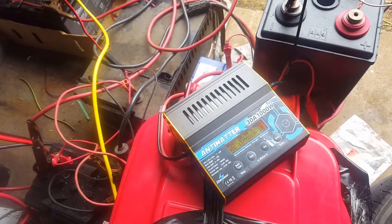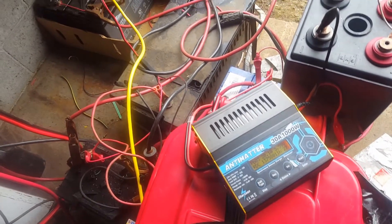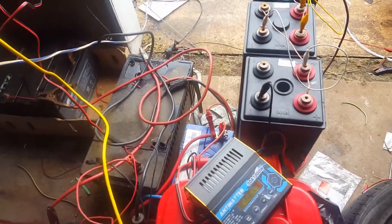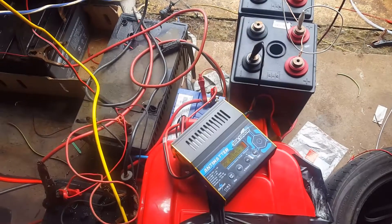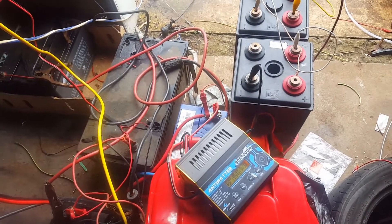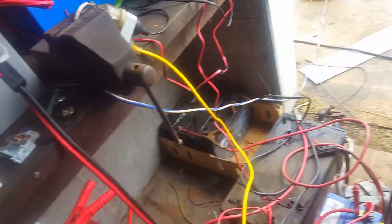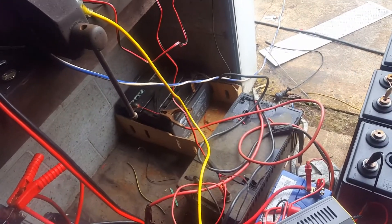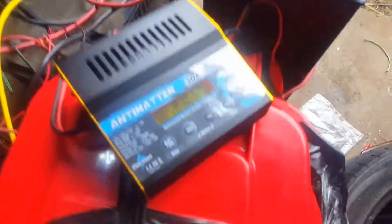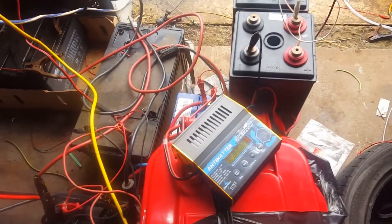It's done well. 137 amp hours at 6 volts — even if you only went 50 amps at 12 volts, taking in a few efficiencies, that's still pretty decent output at 50 amps. Considering these are at 13 volts, we saw 13 yesterday. We'll let that go again and hopefully we'll be done this afternoon.